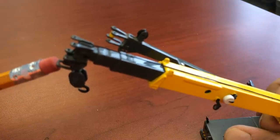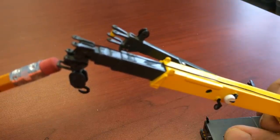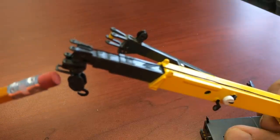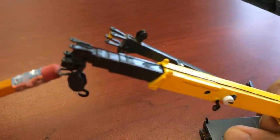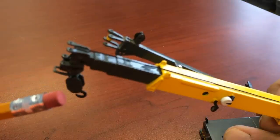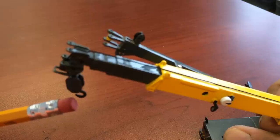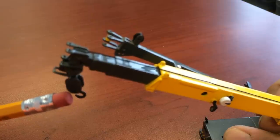So the manufacturers decided to come up with what they call an A2B — an anti-two-block system — because when the block hits the little shoe, it shuts off the hydraulics, and either you have to reverse it or you have to override it with a key. Or if you have an LMI — a load moment indication system — the buzzers will go off and the lights will go off, and it'll lock you out also.